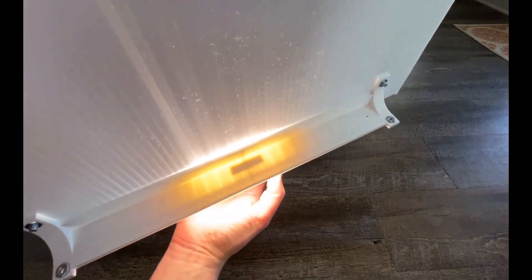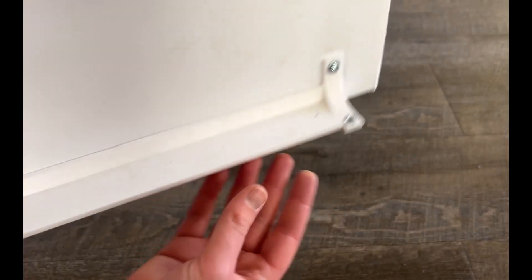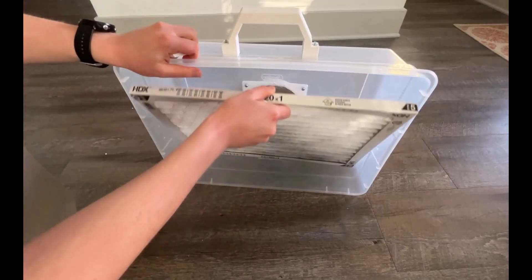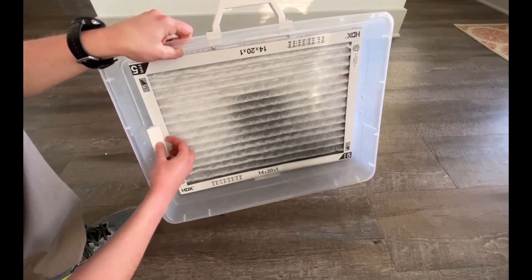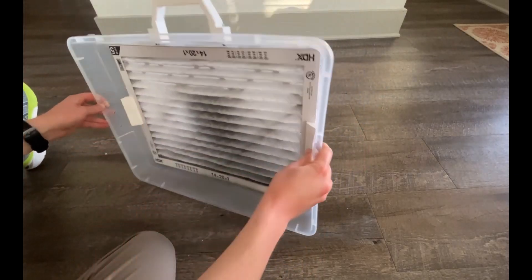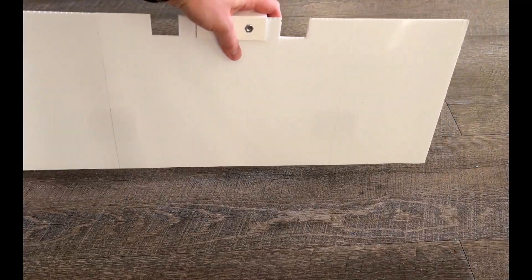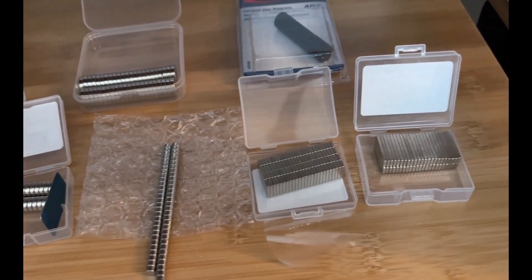In this case, I used a plastic tile as the locator and some CA glue. I largely used button head machine screws and nuts to make everything together, which gives the spray booth a very sturdy build. However, for the two parts that hold the air filter upright, I simply used a few neodymium disc magnets — this allows for quick change out of the filter. Magnets are a glorious way to join 3D printed parts to other things; they are a simple but extremely effective way to produce a semi-permanent bond. I also used bar magnets for an easy connect-disconnect 3D printed adapter to join the roof panel assembly together. If you have access to 3D printers, stock up on magnets — for functional parts, they are indispensable.